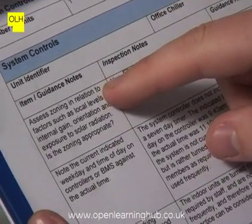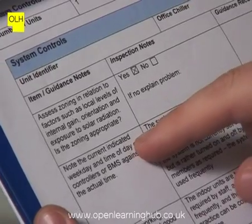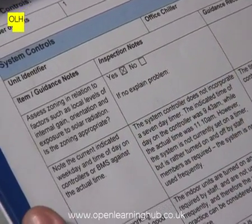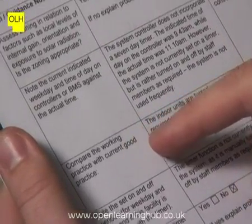The building manager has set this at 30 degrees at the moment. It is off — it won't come on and heat up the space to 30 degrees — but it is worth recommending within our report that the time, date and temperature are reset. The recommended set point temperature would be 22 degrees, so that when any future occupants come in they can see how it should be set up.